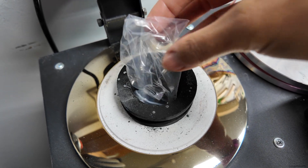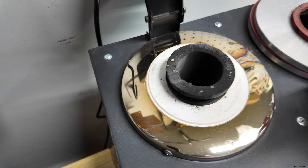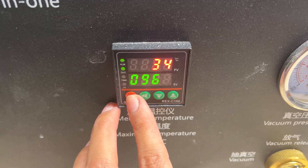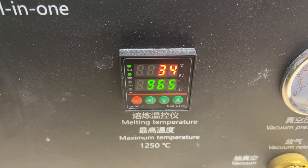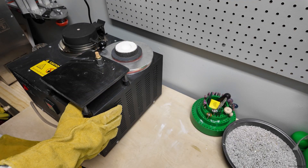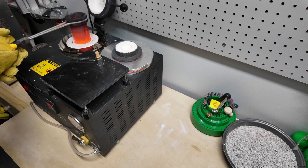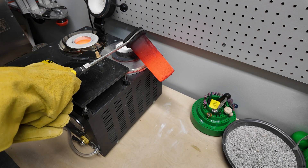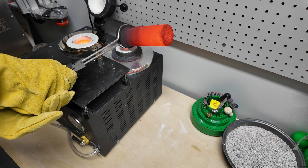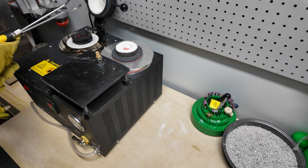At the final stage I'll decrease my kiln temp to 600 degrees Celsius. When my kiln's at about 650 degrees Celsius I go ahead and add silver to the crucible and set my melting temperature — the temp may be a little different depending on what metal you're using. Once your burnout's complete and your metal's at temp, it's time to see if you wasted 13 hours or not. Please do not forget to turn the vacuum casting chamber on before pouring your silver — I did that on my first cast and seriously wanted to cry. That's what helps the metal pull downward, so it's super important.